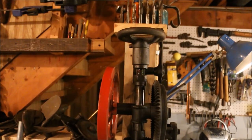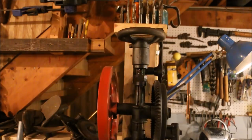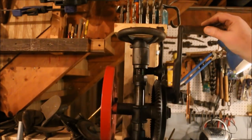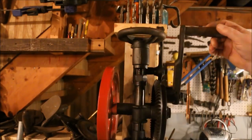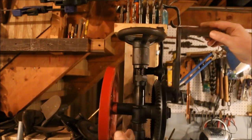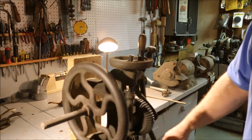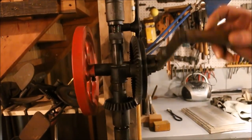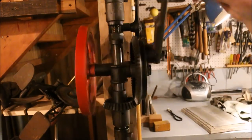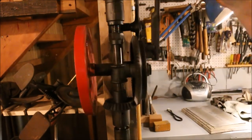When I was moving from the old shop over to here, this was sitting on the back of the truck and I didn't have it tied down — my fault. It fell out of the back of the truck as I was turning out of a driveway. It landed on that wheel and snapped it, busting all the spokes out of it. I was able to braze it back together again but it didn't come out exactly perfect — I got it to work fairly well as far as run-out on the diameter, but I wasn't able to get the shaft exactly straight in it. It should spin straight and true like this one. The purpose of the flywheel is to add momentum to the operation and smooth out the travel of the spindle, so it operates very well.